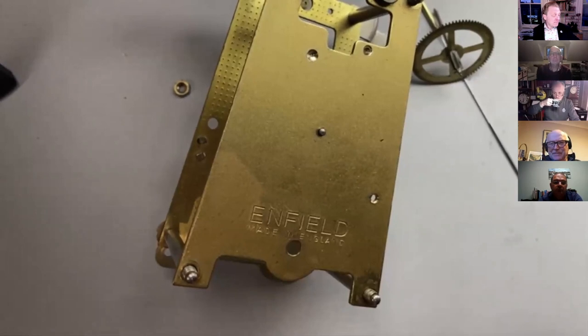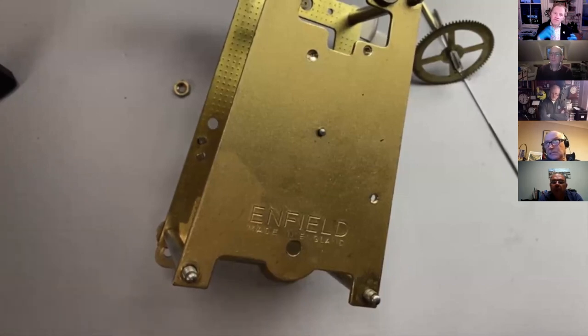So from last week, we have quite a lot going on. I've got my list here. Rob asked, could polymorph be used as a boxwood chuck? What a boxwood chuck is, if you imagine you want to hold some work, say you're holding a barrel and you want to bore out the barrel concentrically to rebush or something, you can't really hold that in a three-jaw chuck effectively because the chance of it being concentric is quite low. And also you've got the problem of the jaws maybe damaging the teeth. So typically you get a piece of material like boxwood, which is why it's called a boxwood chuck, and you bore that out in the chuck, and then you fit the barrel into that.